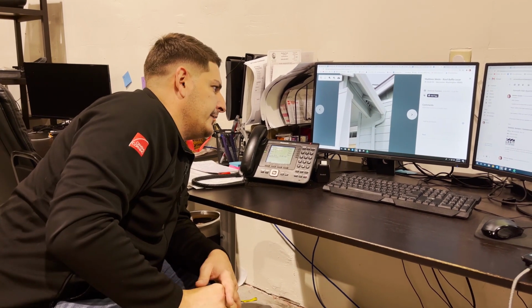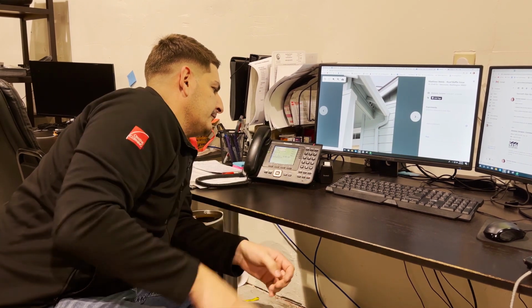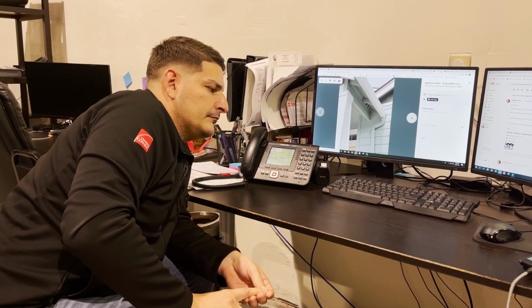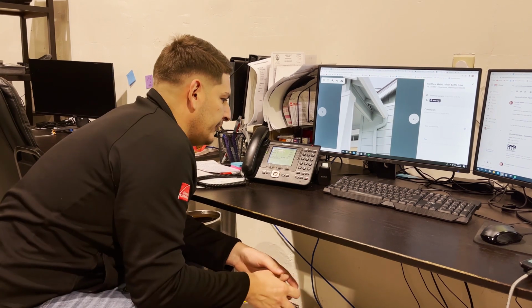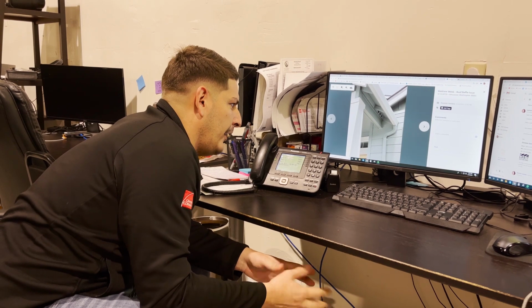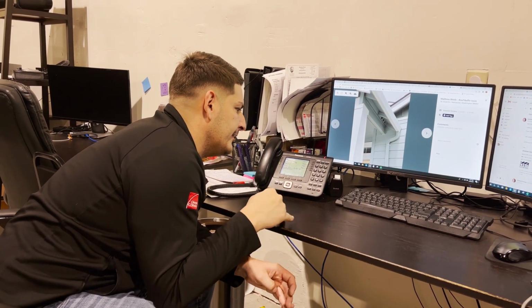So I know I'm a fast talker, but especially when you see it, it sounds like you definitely know what's happening. So I understand, is it the placement of the vents or the types of vents? It's the placement of the vents. Those vents would work dynamite on the top of the roof wherever air is coming out. As soon as you put them on the bottom, the air starts coming inside of them.